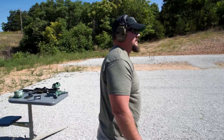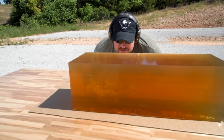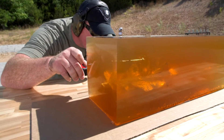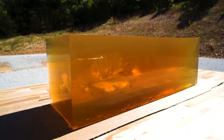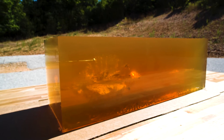Let's go take a look at it. So we've got a good inch of penetration before we get to the balloon. We've got a good seven inch balloon. We've got petals that come all the way through to about 11 and a quarter inches, and then the base actually went all the way through the 24 inches.